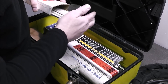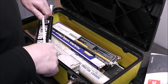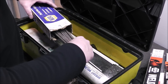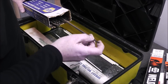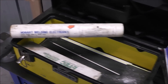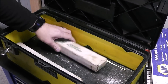So it looks like we've got some 1/8-inch 6011s — that's a nice hot rod, all position. Some 3/32 6013, we've got one. And we've got some brazing rod — not TIG brazing, but brazing with a torch; if you guys have oxygen-acetylene, that's a fun thing. We've got some big 7024s — that stuff lays down super fine. Got some old Hobart electrodes — $9.75, I believe that's five pounds. And some gouging electrodes — pretty old school; you won't use gouging electrodes much, if ever, as a hobby welder.